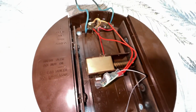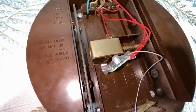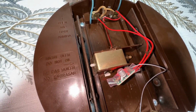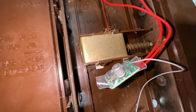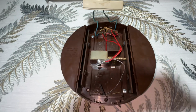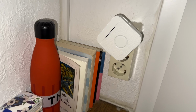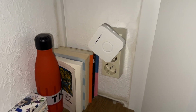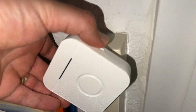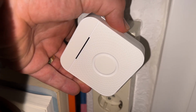With this wireless chime here, we can choose our favorite melody from 58 different polyphonic bell melodies and change them as you like. The volume can be adjusted to 5 levels from 0 up to 110 decibel. The connections are possible from 3 up to 24 volt AC/DC doorbell systems. The power supply via the bell transformer or mechanical bell is possible.